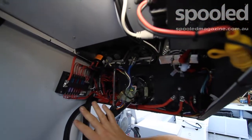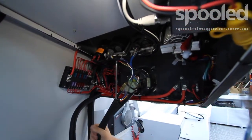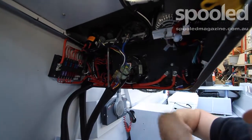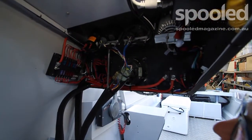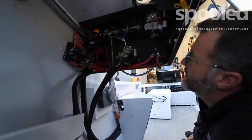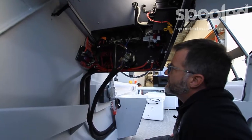The rest of the system is all tied up away — you've got your looms from your hydraulic systems in here as well, all squared in nice and tight. The main thing is it's vibration-proof. You're out in the water, banging away on the ocean, and this has to be able to handle all the rise of the sea so you don't have any wires breaking along the journey. Some time and care in this area is really important and will give you a lot more reliability on the water.